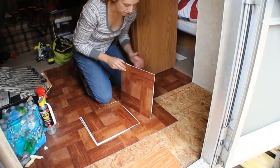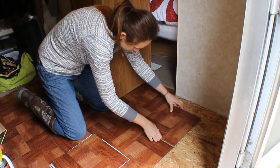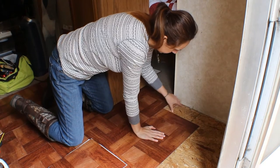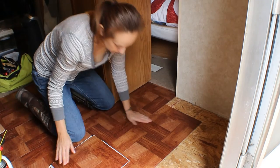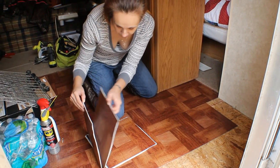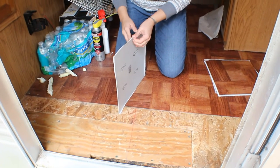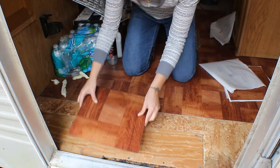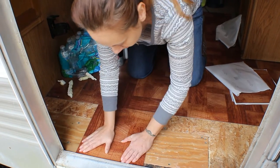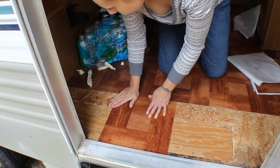Now that the component is gone, we are going to lay tile where it used to be — it's just as easy as it was in the last videos, just lay it down, push it down, and it's good to go. I'll do a little cut here so that it's nice and flush with the wall. I also have to replace these tiles at the front since they were cracked. You can still see our chalk line from before, which is very helpful because I don't have to guess where to lay the tile — it's already marked for me. Just follow the chalk line, make sure it's nice and even, lay it down. There's a little gap here but that doesn't matter because we're going to have the kick plate right there in the front and you won't even be able to see it.